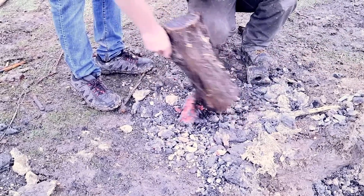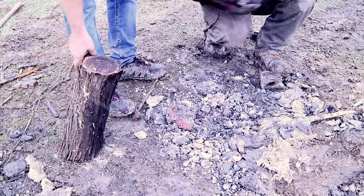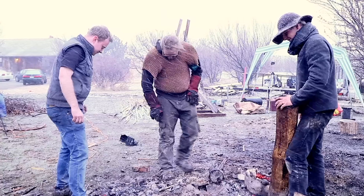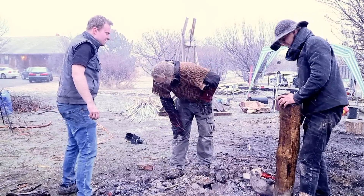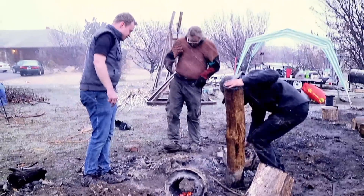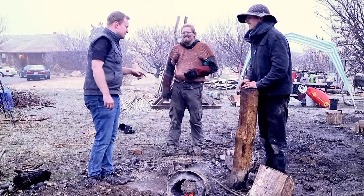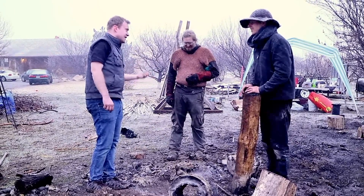It's definitely deforming. At these temperatures it would form a black oxide almost instantly, so this metallic... that's why I'm not seeing anything shiny. That's tremendous. We'll let it cool off. So we think we have a bloom — about two apples' worth of iron. The next stage is going to be to take an angle grinder to it to test.